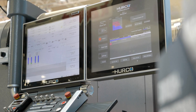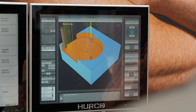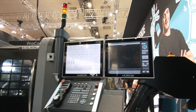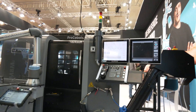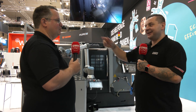We've spoken a lot about the programming capabilities on the milling machines, but what sort of capabilities do you have on the lathe programming? They're quite similar — you have the DXF option on the lathe as well, you can have the linear broaching, and the same type of programming. You have a part setup, tool setup, and part programming, so it's almost the same. Am I right in saying if you can run a lathe, you can run a miller — and if you can run a miller, you can run a lathe? Let's say with a little bit of starting time.